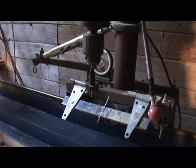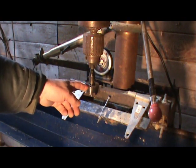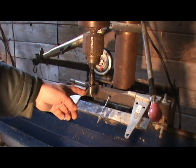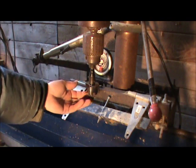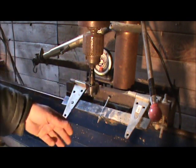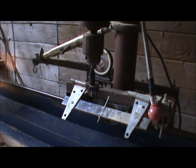This is a one-horsepower drill and it has a lot of power. When you're using these two and three-inch bits, if you get your clothing caught in here it'll hurt you a lot. So if you're going to brush away the chips that come out, take a stick and brush it away — don't use gloves or anything loose around there, otherwise you will pay the price.